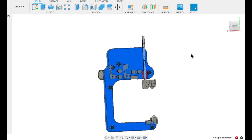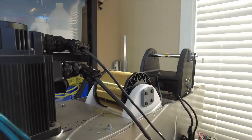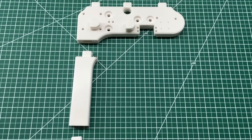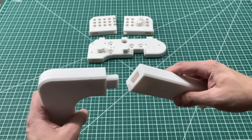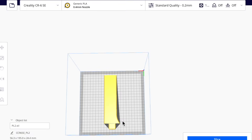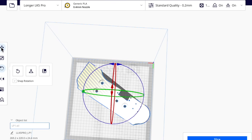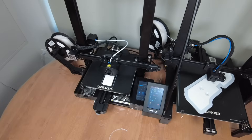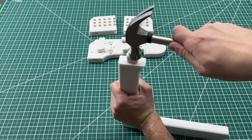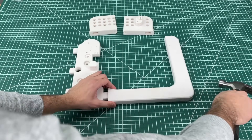Before we invest in making a rigid metal frame, I decided to 3D print this design just to make sure everything works as intended. This was far too big to print in a single print, so I broke the design into five components. Each of these components has a key and a hole so they can slide into one another precisely where they're supposed to. I selected to print them with 100% infill to ensure they're as rigid as possible, which made the print time for each part about two days long. When the prints were finally done, we assembled the frame into a single component and no glue was needed as the press fit did the job really well.